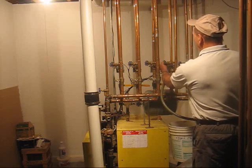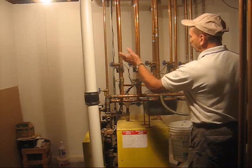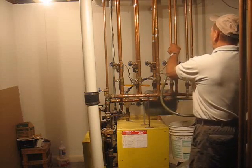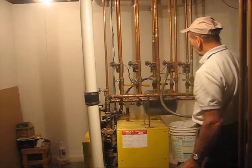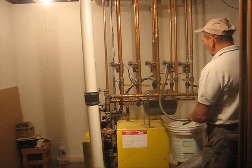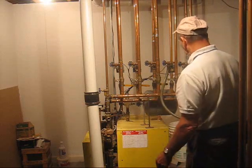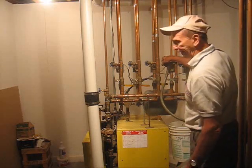What we're going to do now is open this valve — these valves are usually all blue or all red or a mixture of both. We're going to open it and drain water out of this circuit as the circulator pushes it through the system. When we get to the point where the air bubble passes through, we'll hear it gurgling in the bucket, indicating that the air has come through the system and water will become a steady stream without air in it.